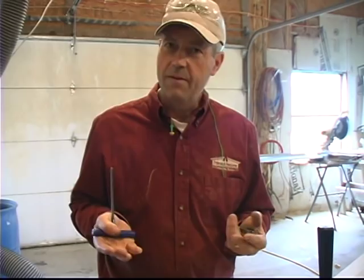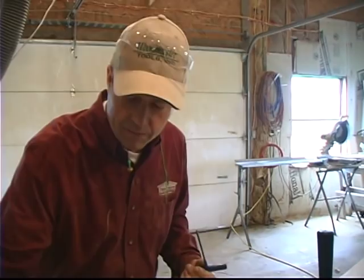I'm setting a back relief knife here. Casing trims always have a little bit of relief in the back. When you put a piece of trim up on the wall, you want it to make contact with the sheetrock on one side and the door jamb on the other. By relieving some material out of the back, you help make sure that that happens.